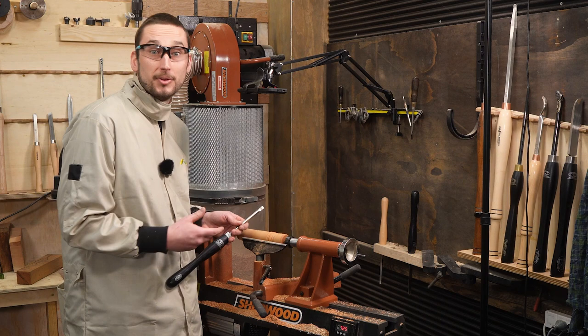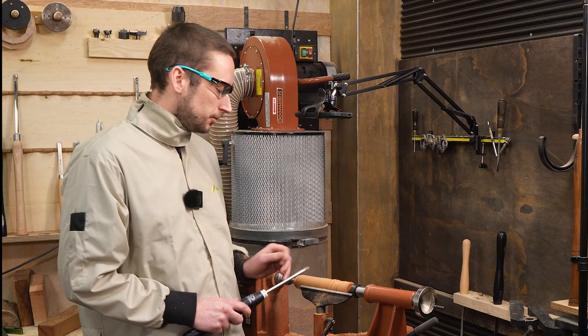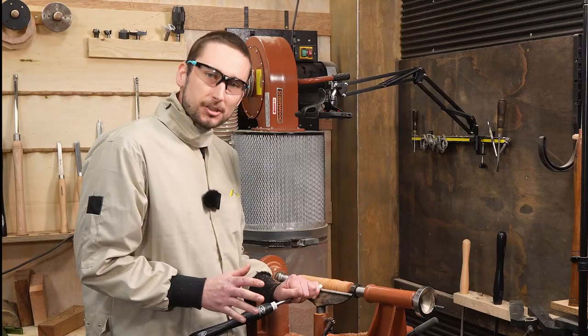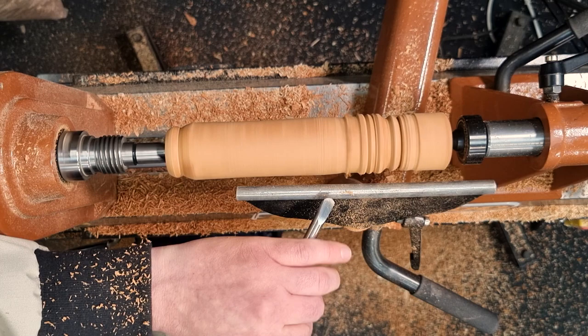It's pretty hard to say, but correct me with a better term down in the description below because I'm really struggling to describe this one. What's interesting is when you're cutting on the tip of the tool things just feel like you're using a skew — fairly controlled but could go wrong at any moment. When you start to cut on the edges of the tip or on the side of the cutter it starts to feel more like a gouge and really, really controlled.